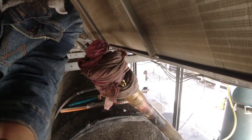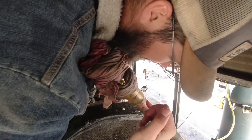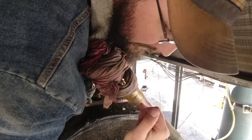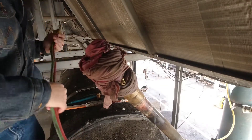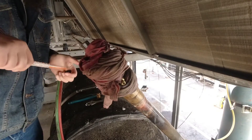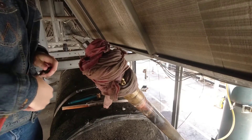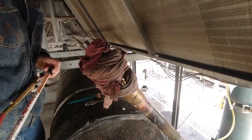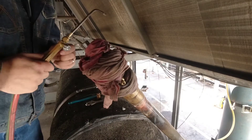I'm going to get this up here where it's most critical, tuck that in, and that'll let me focus my heat here while protecting the valve body from overheating. We just need to come in right here and fix it. One thing about the orange flux is you have to really control your heat because it's so fluid and it flows at a much lower temperature than 15% silver — it's got a higher silver content, so you can't put as much heat on it as you would with 15%.